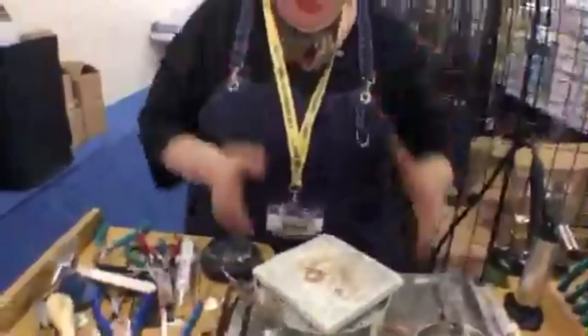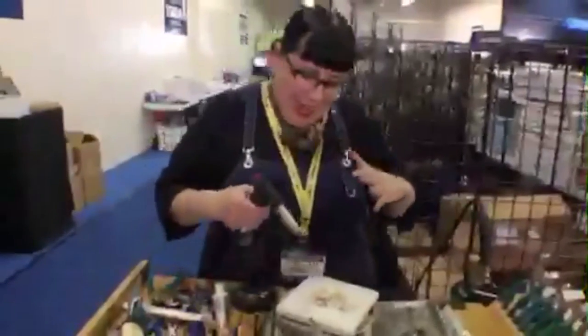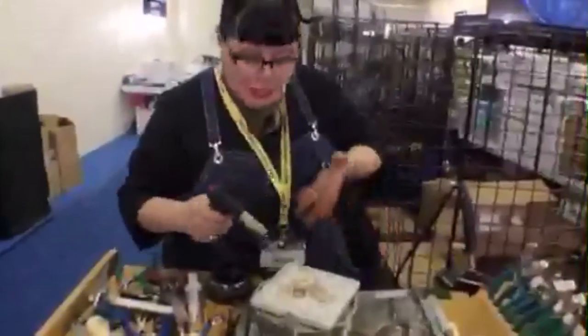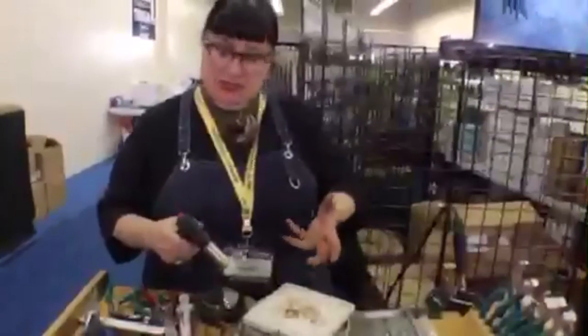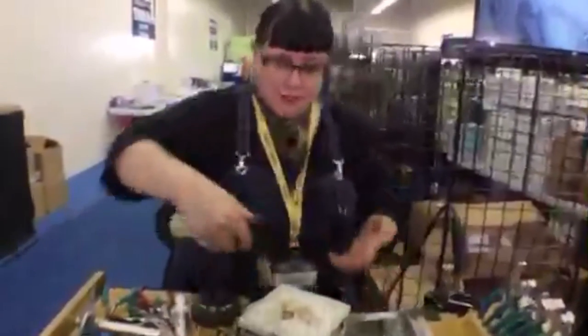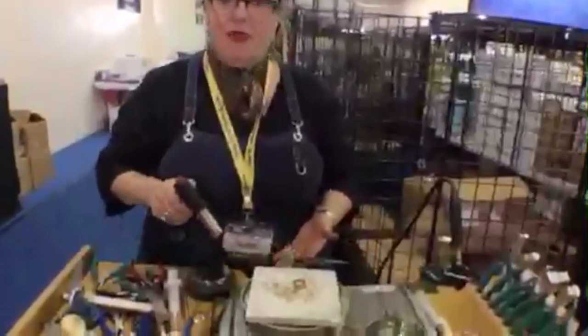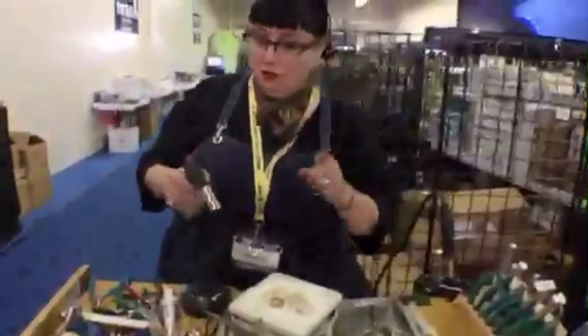I'm going to put one more solder ball on the inside — there we go, I like the looks of that. Now, this is what makes this soldering pan my favorite tool. When you heat the solder and push the flame through the join, the solder follows the flame of the torch. When my solder board is stationary I have to wiggle my hand around, but on a soldering pan like this I can just swing it around and pull that solder through.